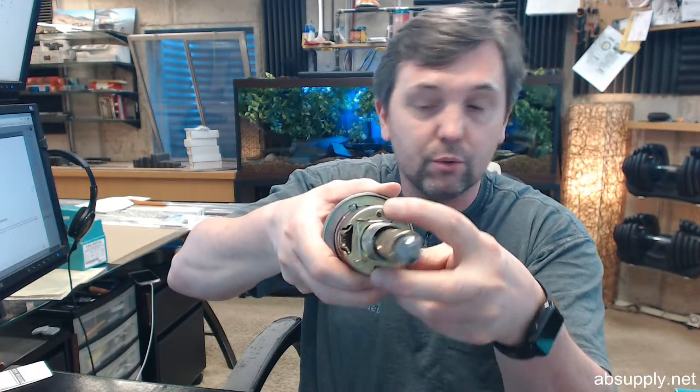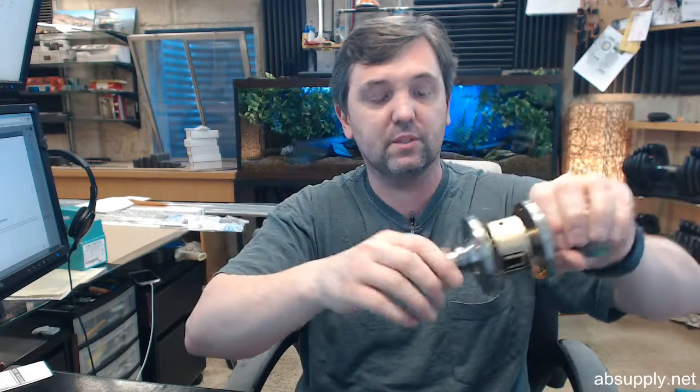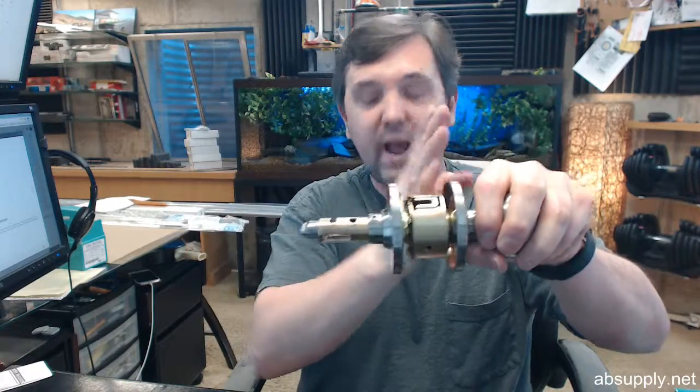That's a threaded rosette assembly on the inside, which I happen to like. Okay. And you've got your plate. The last 2 screws are those longer machine screws. They will go through here and into the tapped area here. Those 2 longer screws. So your plate is on. The door is now actually attached. You'll bring this from the inside, thread it down until it stops. You're going to want to have that balanced equally. Both of the inner and outer rose assemblies are threaded, so you're going to want that to be balanced equally.